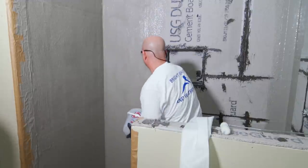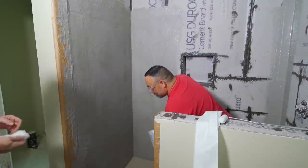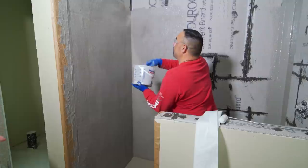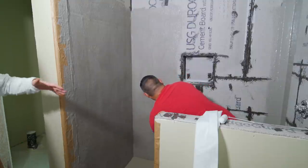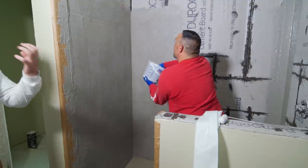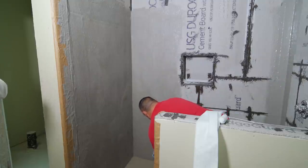The main purpose of the sand is so you get mechanical adhesion to the thinset. The more sand embedded, the better. It's roughly about 30 pounds per 100 square feet. If you're getting a lot of sagging, you can use less material for the kiss coat. The main thing is when you finish, make sure that as soon as you're done with everything, you get some sand embedded into it — that way while the 022 is curing and hardening up, it bites that new sand. If you think it's been a couple of days and you forgot to sand some areas, the problem is part of it's already hardened up and cured. Then you're putting a new layer over the top of that — you want it to be in the full curing process.